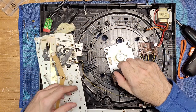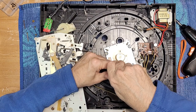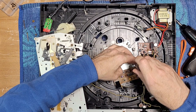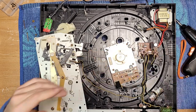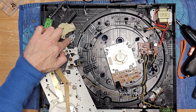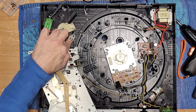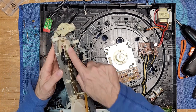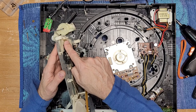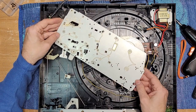The plate is all plastic. Need to put this back. If you did have an arm that was dropping very quickly, it's very easy to service the pop-up mechanism and apply some fresh silicone grease. Here's the auto return sponge — it looks to be in okay shape. If you're having issues with auto return, you'll probably want to remove and replace this little piece of sponge. But this one was working fine so we're not going to touch it.